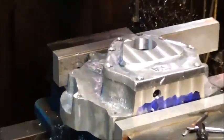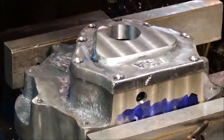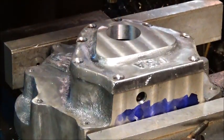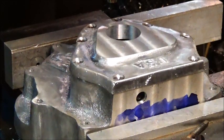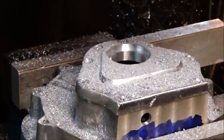Okay folks, I've got this hole done. What I'm going to do is pull the cover back off, get a distance from the inside of the case to where my points would run, and where the seal needs to be. Then I'm going to surface up a place — or build out a place — for my points plate. I want to do that before I move the table and do the cam hole. I've set my height where I wanted it and I'm just coming down and boring it until I get where I want to be.